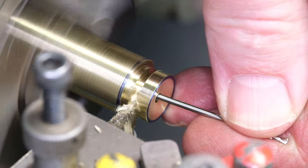I can see this little bracket called the minute cock is sloppy in its fitting, its taper pins. So I plug the movement frame holes and re-drill in the original site of the pins to make the minute cock a snug fit, with better depthing between the minute wheel pinion, the small gear, and the hour wheel itself.